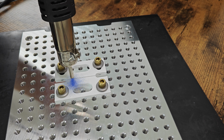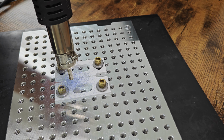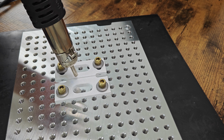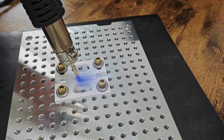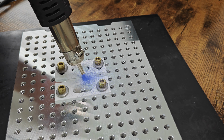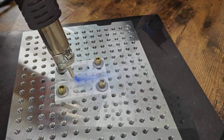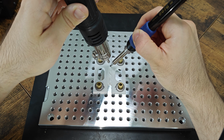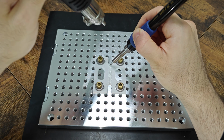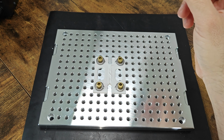Hold the heat gun at a slight angle so that the hot air is moving towards the current weld area, but then moves in the direction of the welding movement. This will help keep the weld moving by preheating the area before the soldering iron gets to it. You may have to adjust the angle back again if more heat is needed at the current weld area. If the part starts getting too hot and starts to melt uncontrollably, move the heat gun away so that the heat being added is reduced. You will likely have to frequently adjust the heat gun position.